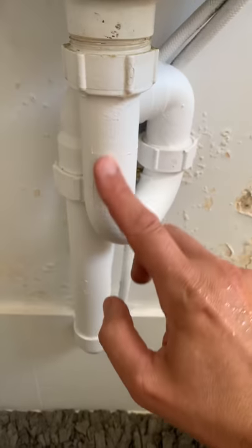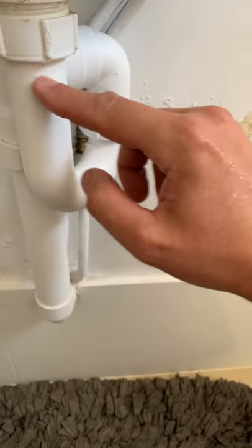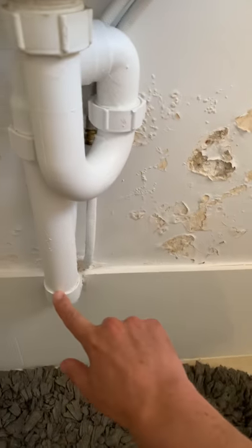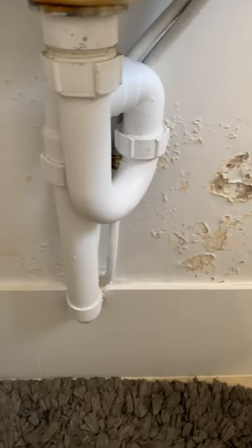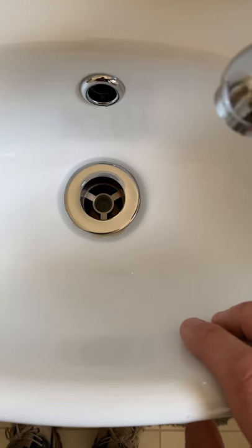You need to be able to force the debris through what we call an S-bend or U-trap, and back down into a drain — getting it through the water seal or the airtight seal which eliminates sewer gases coming back up and into the hand basin.